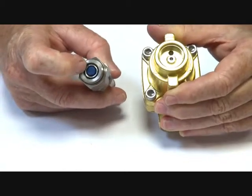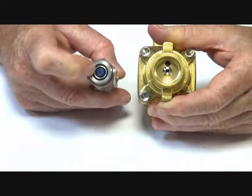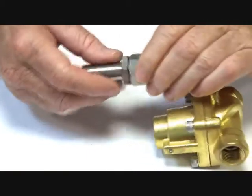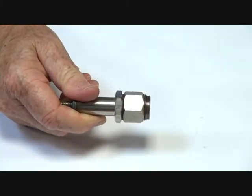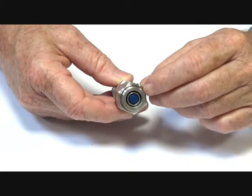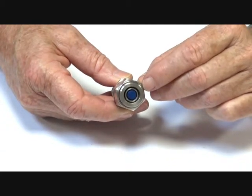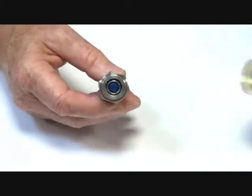The valve has a PTFE material for its armature seat and there are two parts to it. There are also VITON sealing rings and metal face backing rings, so they have a dual sealing system on the top of this valve.